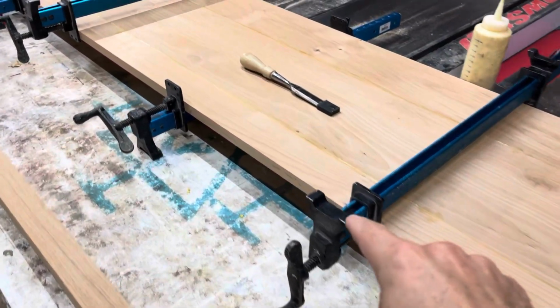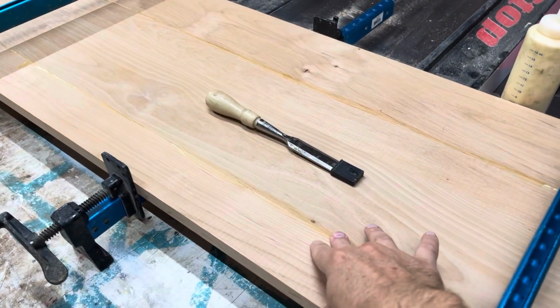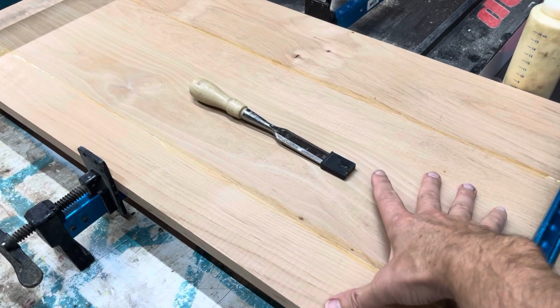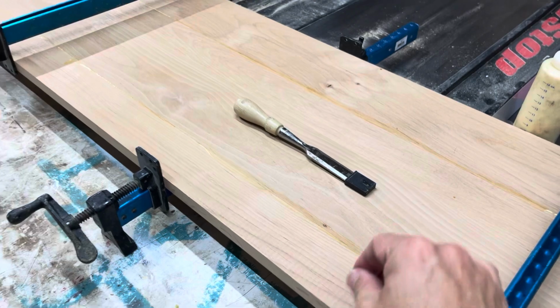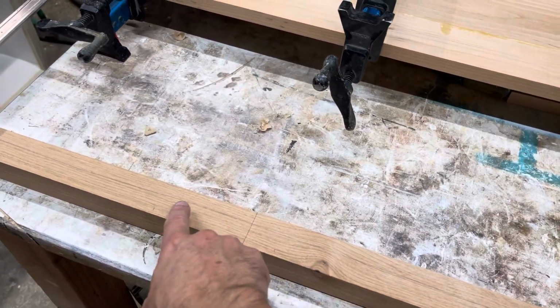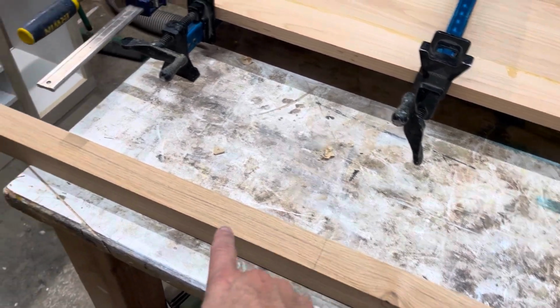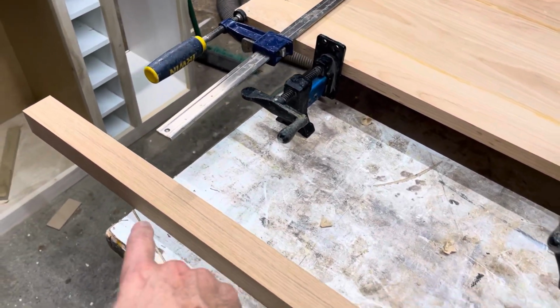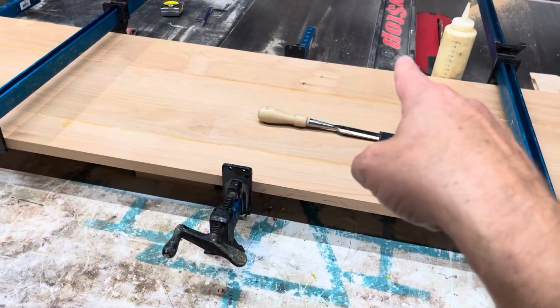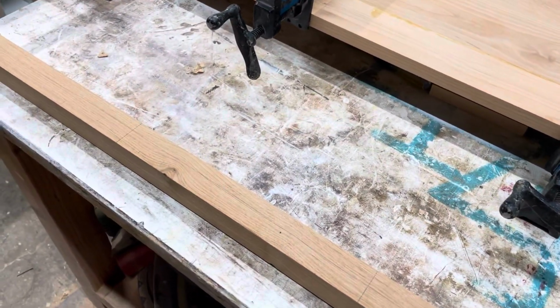All right, so I have more wood now, and I have glued the larger rail pieces together. So these will be 8 inches now instead of 5¼. And now that I know that, I can work on finishing my layout because I'm going to have to make a jig for the tapered portions. That jig will clamp this all down and I'll be able to run it through my table saw to cut those tapers.